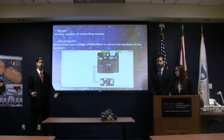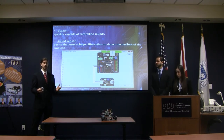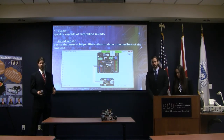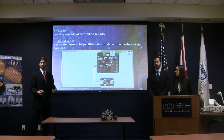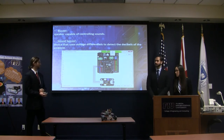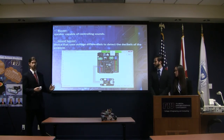We also tested the buzzers — the speakers. We uploaded several music programs that worked by converting musical notes into frequencies and then into their corresponding analog values so the microcontroller could read them. Even just for fun, we were able to play things such as the Star Wars theme song for students to play around with. We also have a sound sensor. We used a reactive feedback program to measure the loudness of the ambient environment, where higher values equate to higher decibel levels.